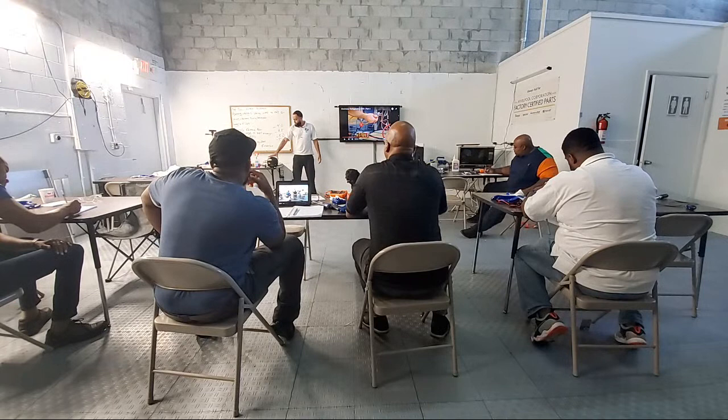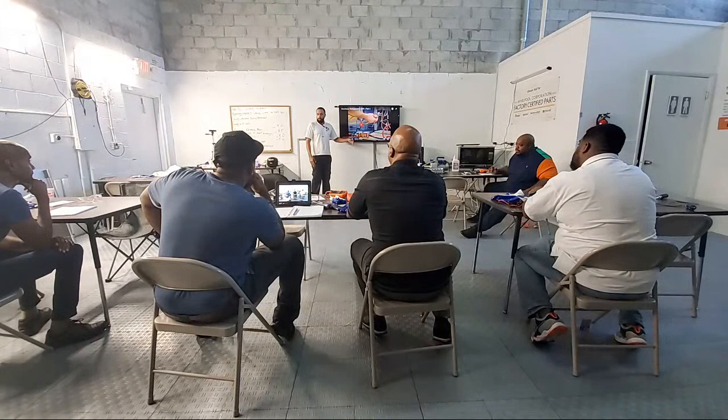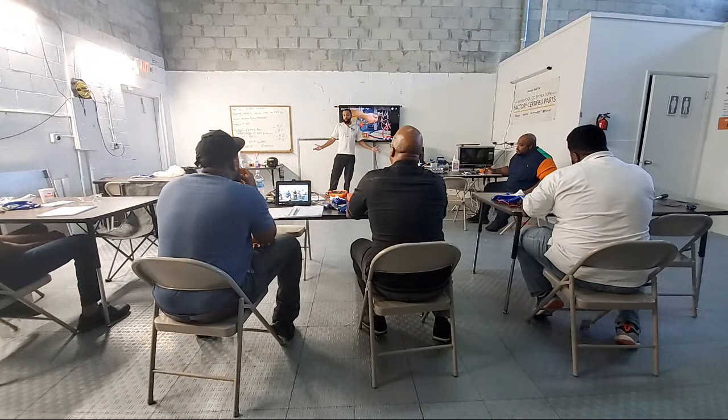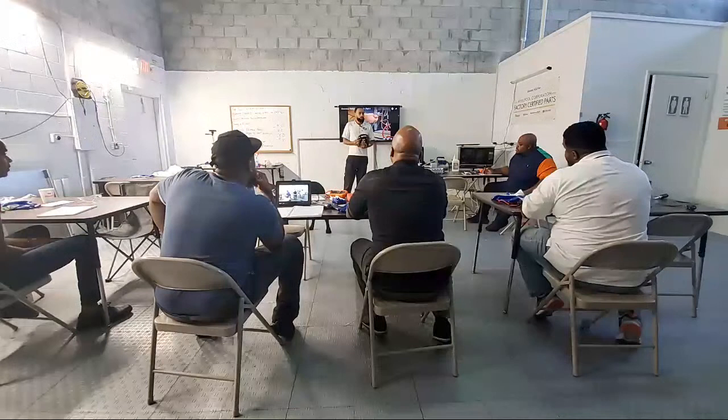Well, brother, you just don't go. That's not definitive. You have multiple red flags. You got a no frosted coil, your compressor super duper hot. You know, you just is gonna go off an amp, bro. Like you gather, you're making the most educated conclusion based off of all these tests that you're running. So we spoke about this compressor here. We said that on this side, you got this little guy by itself. What's that for?